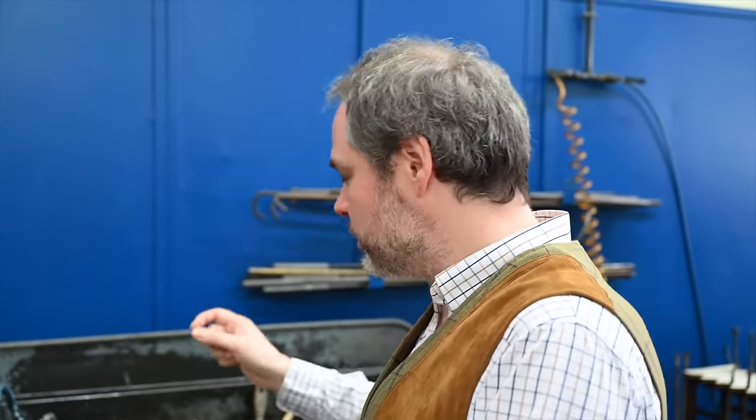And also, there are some segments in the tube, so you have the chamber, a first cone, then the tube, a second cone, and then the choke zone. And it's made by tools, so you have sharp edges after the machinery. Using lead allows us to round those edges a little bit. And when you shoot lead, for example, having something smoother will keep all your pellets more round, and that will give a better shot. Plus less fouling on the internal barrel surface.